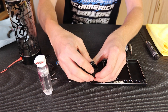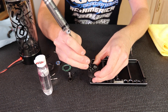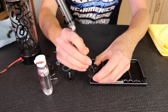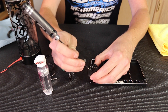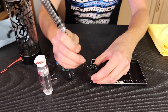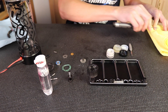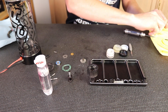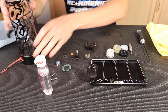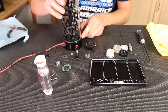Once I've got that side done, I'll put it in and align the pucks again. Then I can take my screwdriver and align the flat spots on the pins with each other and kind of push them together. I'll spin the gears to make sure there's oil in all the gears and no air bubbles. I'll also push oil on top of the pins in that little square spot right there, making sure there's no air in there either — just kind of push oil into each spot. Now I'll place the diff into the air vac and suck all the extra air out.